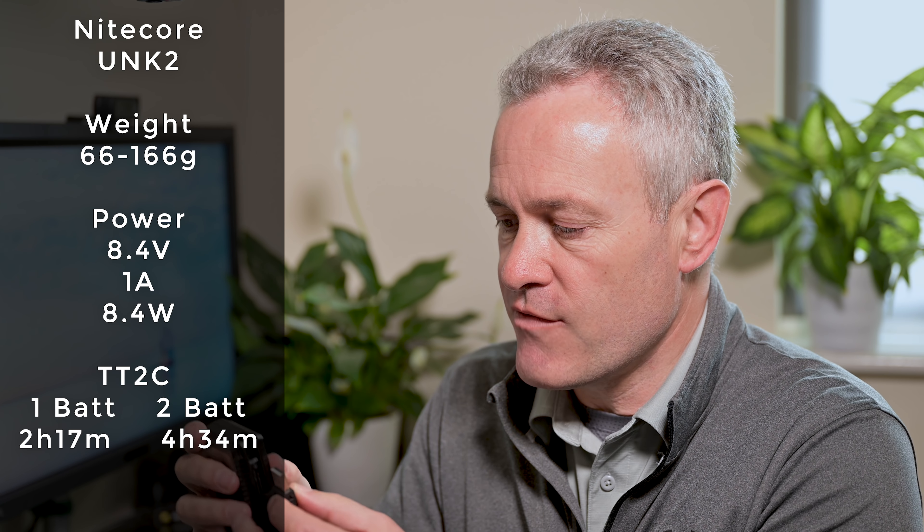Looking at the X-Pro Dual Digital, I charged both a single battery and two batteries. The theoretical time was about 1.5 hours for one battery and 3 hours for two. In the real world test, it took about 2 hours 19 minutes for a single battery and 4 hours 40 minutes for two batteries - a little longer than the MH25, but very slightly shorter than the EH7P for a single battery. If you've got two batteries to charge overnight, the 4 hours 40 minutes for two batteries could be advantageous.